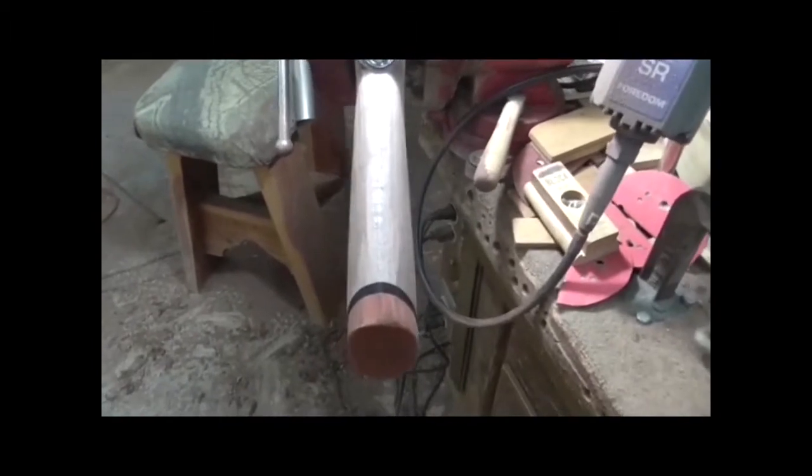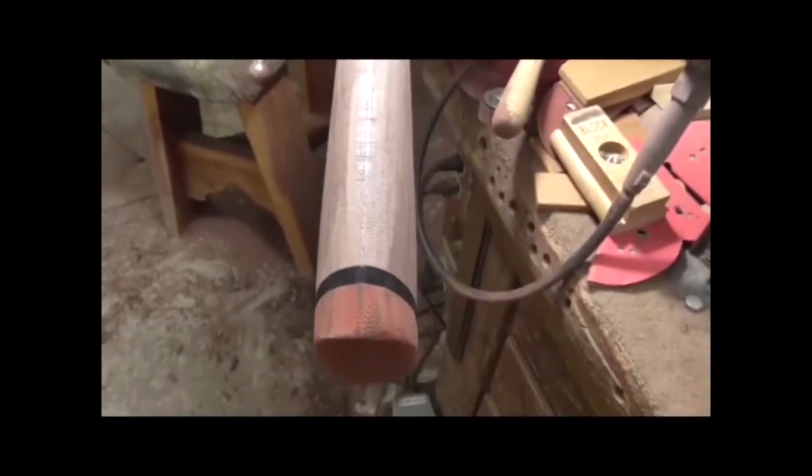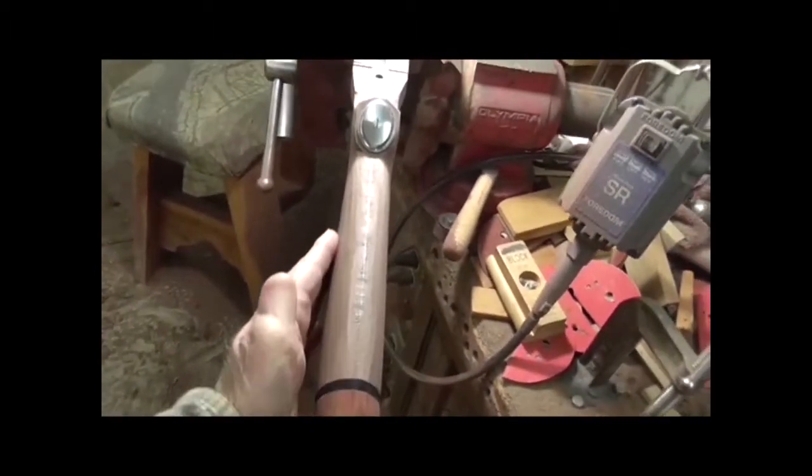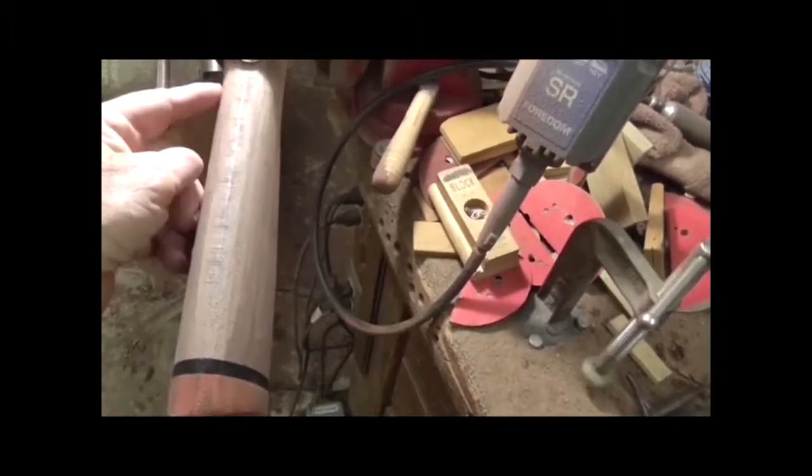I want to try this with a handheld variety for a minute and show you how that light needs to be very centered right down that stock. You can see my center line is still there, my pencil line. That's a reference. It'll go all the way up through the middle of that trigger guard, all the way out the end of the barrel. And by working with your eyes in line with that light and in line with that center line, you can take that grinder and just look at the profile of it. Move around, look at the straightness, the straight lines. There's got to be a straight flow from the tip of the pad, from the toe, all the way up to here. This is slimmer, this is rounder, a little fatter.